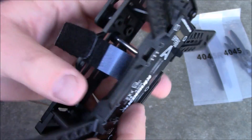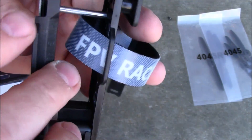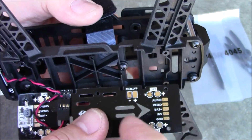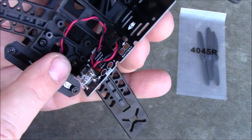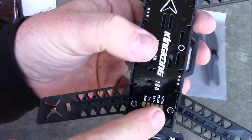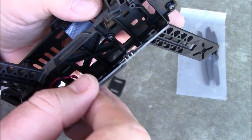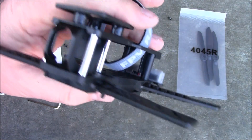On this side here's the battery lead, and it feeds into nowhere, so you kind of have to have your battery connection coming in on this side. The nice thing about having your camera wires in here is they can drop down through these holes and come out the bottom to solder into the battery leads. The same is true for the back — they can drop through holes in the bottom plate and solder up to the power distribution board just fine. It should be pretty slick having it all enclosed, and you still have access to all these solder points on the inside.